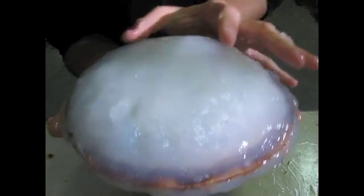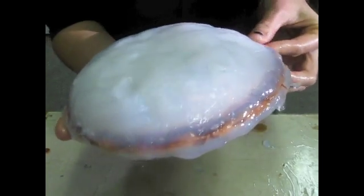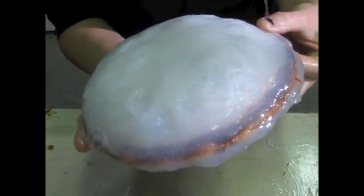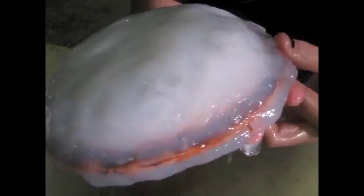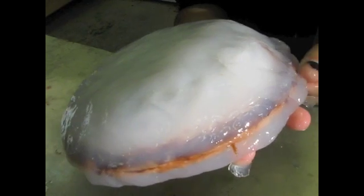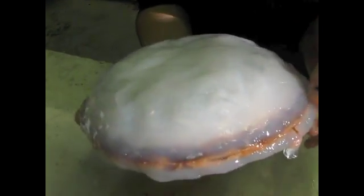Can you tell if it's setting while you're working on it? Yes. As it starts to set, it gets harder to push together with the other pieces. You kind of start getting segmented — like here I'm working on a little flap, trying to get that into the mold. Just knead it in, cover it, dig it back in. There is a point where I can't do anything about it — I'm almost there.